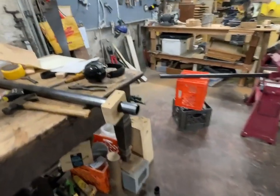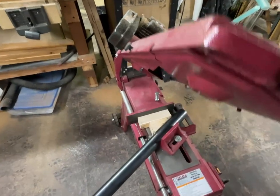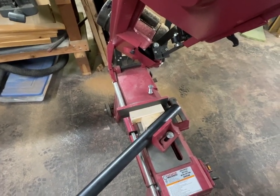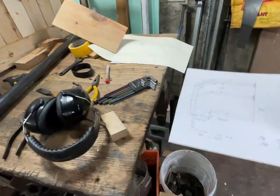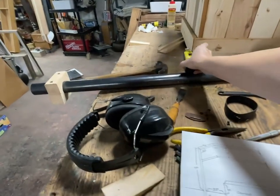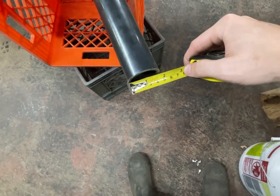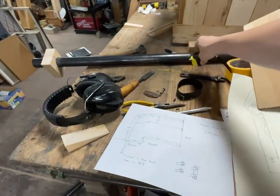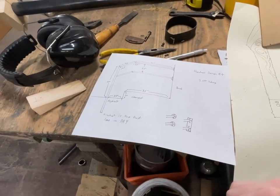How I'm getting the angle right is I made these little wooden blocks — it's absolutely perfect for angling the pipe. This is just based off of the angle of the miter saw. Now forgive me, I did make a mistake: I have one and a half inch tubing, not one point two five. Yes, one and a half inch OD at least. So this measurement was wrong.